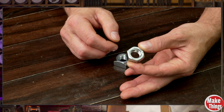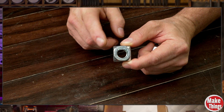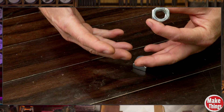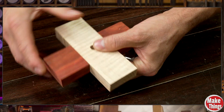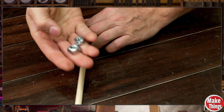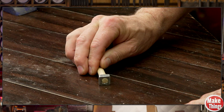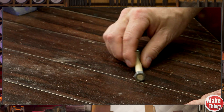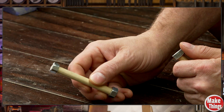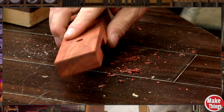But why a square nut and not a hex nut? In geometry, every time you add a new point to a shape, the greater the chance for that shape to pivot or twist. The most difficult shape to turn would be a triangle, but mechanically that would be tricky to use in a knob. A square is the next best thing with only four points. If we jump up to six points, we're making twisting much easier — a shape with a hundred points is basically a circle and spins freely. This matters because every bit of torque we apply to the outer points of our knob translates into enormous twisting leverage on the nut. Take a dowel and a couple nuts — jam the dowel right into a square nut and a hex nut. You'll notice it's very difficult to roll the square one, but switch to the hex and it's not a problem at all. Square nuts are more difficult to twist than hex nuts. And cutting a square hole is so much easier than shaping six angled walls — a Forstner bit, quick cleanup with a chisel, and you're done.